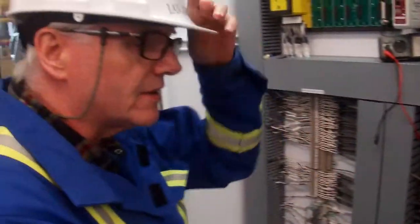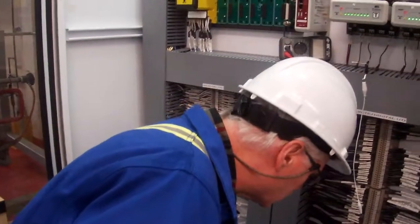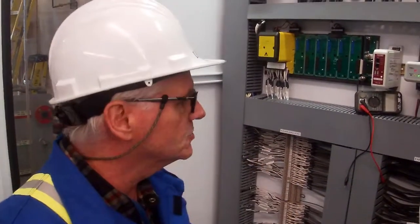So now we know that we don't have any shields touching our wires, and we know that we're not going to get any shorts happening. So that's our resistance checks, the first part of our static checks completed. The next part is we need to check the capacitance, and the capacitance we should be reading is what we have out in the field, which is a 100 ohm terminator, right? 100 ohm and 1 microfarad. So we have that terminator on there, plus we're going to get capacitance in the cable as well.